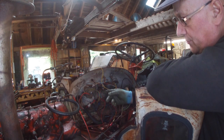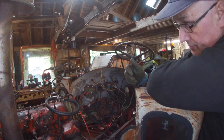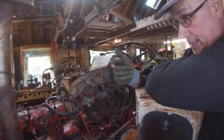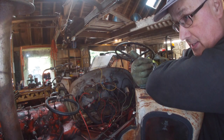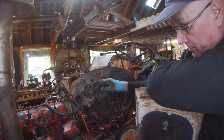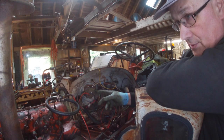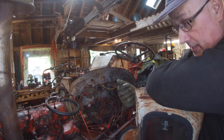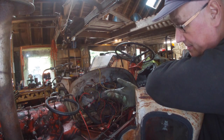So now when you turn the ignition on, you're energising this wire and all the green power supplies. And then the next, so it's off, ignition, heat to the glow plug up there. And the glow plug diesel can flow through it. So when you put it to heat, you're energising the coil and heating it. And then when you go to the next position, which on this tractor is the starter solenoid, it also keeps the heater on, so the whole time you're turning the engine over, the heater's still on, and you're getting heated fuel that's on fire, basically. I think that's the idea of it.